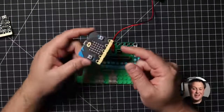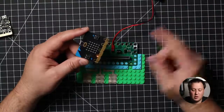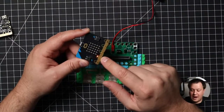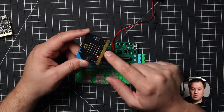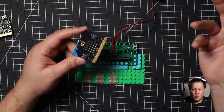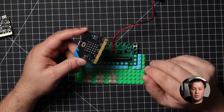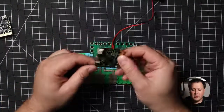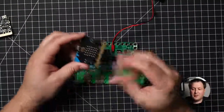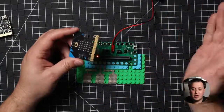If you want to make a scary sound effect, what you could do is not use pin 0, because that's hooked up to the piezo speaker. You could alligator clip over to pin number 1 or 2 with the capacitive touch aspect, and then clip to a doorknob or something else that somebody might touch with their body. And then when somebody touches it, you could have a spooky sound effect play with the piezo speaker on here. Or a light effect or sound effect happen with just a simple touch.